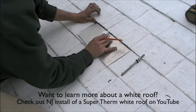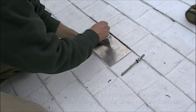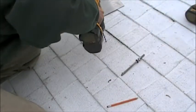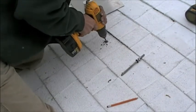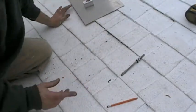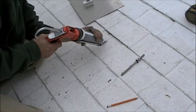I have already marked my roof rafters with a chalk line and have loosened my shingles with a flat bar. I now mark with a pencil the point at which I will be drilling my pilot hole. I also made sure that the flashing didn't hang over the edge of the shingle — this is done to prevent debris from collecting underneath of it. Once the hole is drilled, I fill it with an asphalt shingle manufacturer approved silicon caulk.